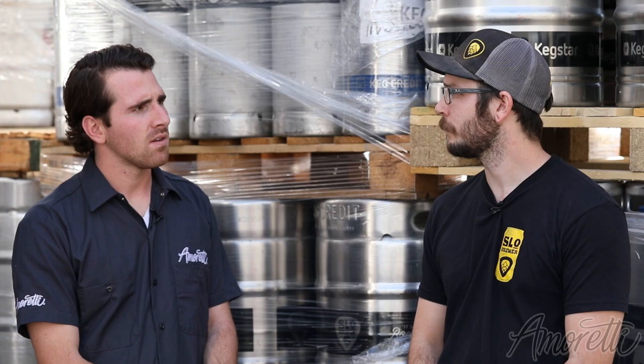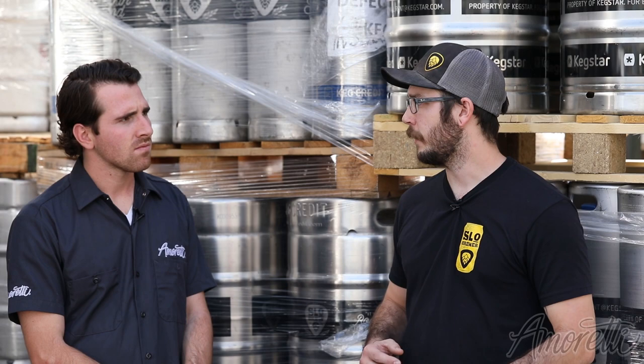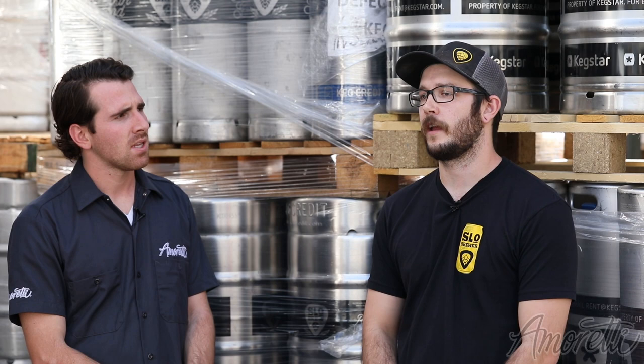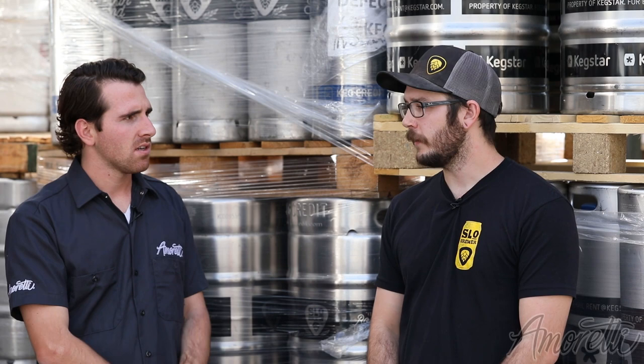One question we get a lot from brewers is how to clean brewery equipment once we've used those strong, punchy citrus flavors — whether it's blood orange or lime zest, something like that. What's the best way to clean the hoses, the tanks, the whole nine yards? We run a typical CIP cycle on everything after we use it. Before that, we give everything a really good hot rinse — we'll put everything we used in line with our fermenter and give it a thorough hot rinse. Then we run a caustic cycle through all of it for at least 45 minutes. We titrate our caustic to make sure it's at our parameters — you want it nice and strong, but not too strong, as it can be dangerous. Everything also gets a visual inspection afterwards. That protocol may vary from brewery to brewery, and caustic can differ depending on the supplier, so follow what your manufacturer suggests.